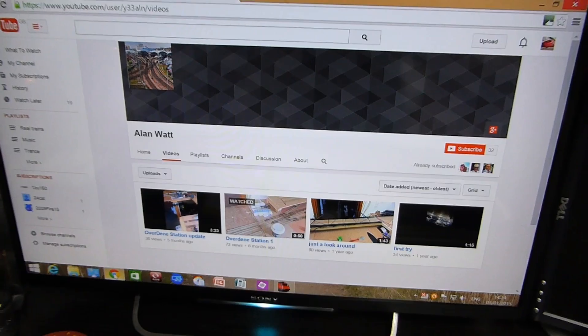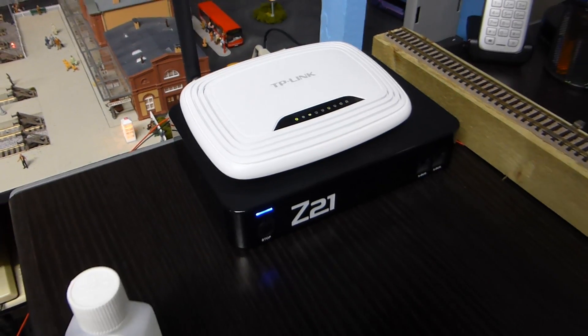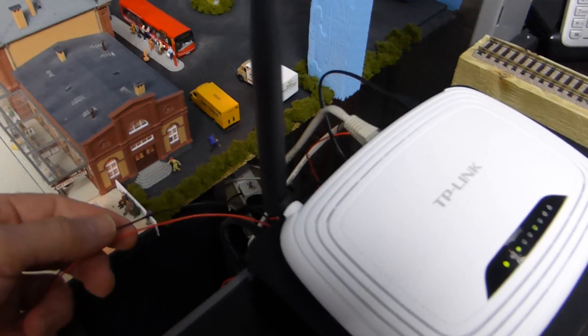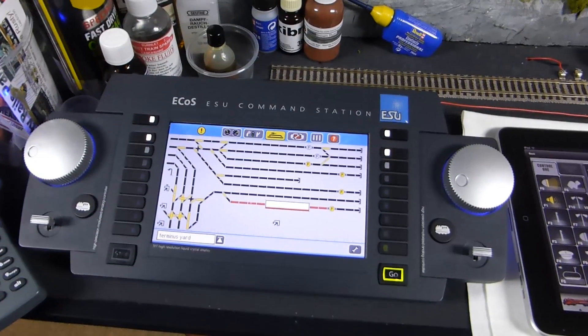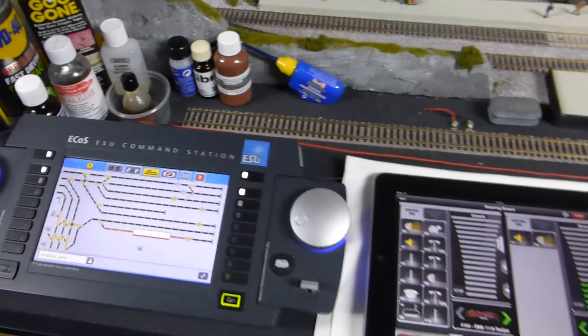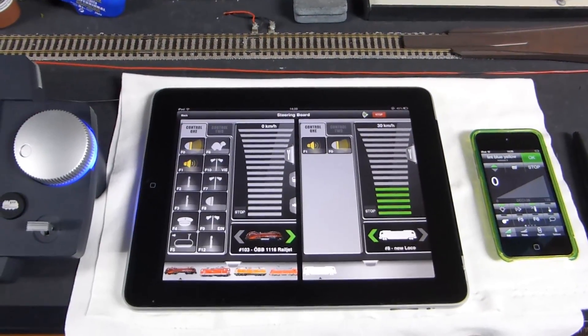It is just brilliant, because basically I've got the stand-alone Z21 system working with its router. You run two wires out — the two track wires go out the back. I've got two going to a programming track at the moment, but the other two go along this long wire and into the back of the ECOS on the sniffer port. The ECOS will pick up on whatever command station you have plugged into the back of it, which I didn't know — I'd never tried it before. And it works perfect with a Z21, no problems at all.